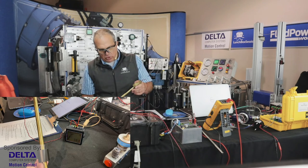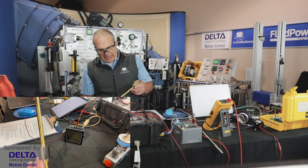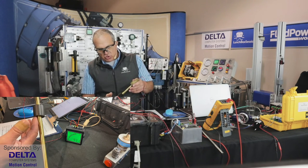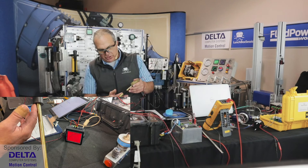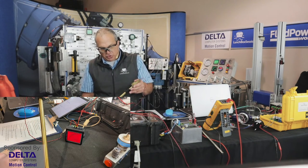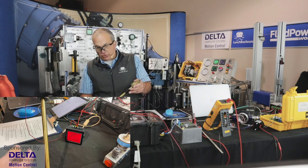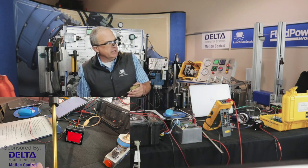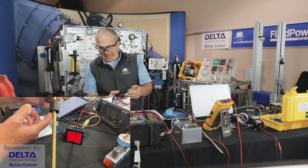Every time this float moves 1/4 inch, we're getting a new reading, 5-6 millimeters, and that's very accurate. So in this case, we just created a scale. We just said maybe there's maximum capacity for 1,200 liters or 1,200 gallons in the tank. And so there's my float up at the very top of the range in the tank.